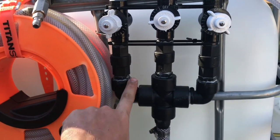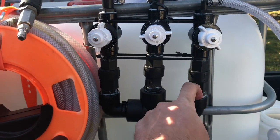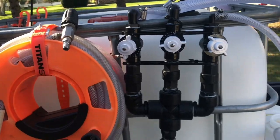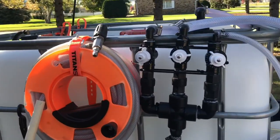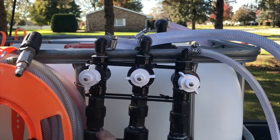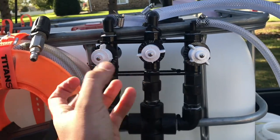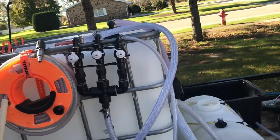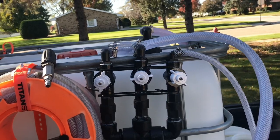That's why I swear by the white tape — I hate dealing with this stuff because it's not guaranteed. It's leaking — I can feel the water. I might have been using the wrong sealant. I was using an all-purpose PVC cement, and one guy's comment had me worried. The stuff comes apart just fine, but I'm wondering if there's a better type of sealant — one that doesn't dry as hard, maybe dries a little more rubbery so it has a little more give if things wiggle and doesn't completely crack the seal. Look into your thread sealant options before you put something together.